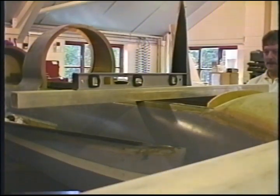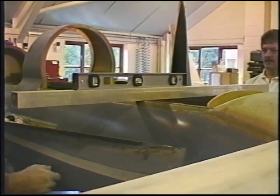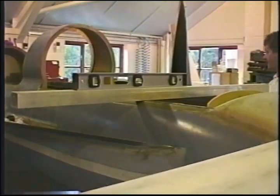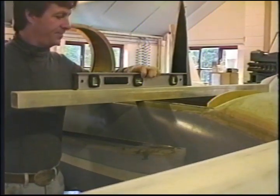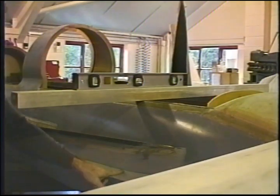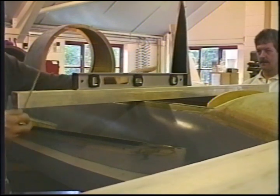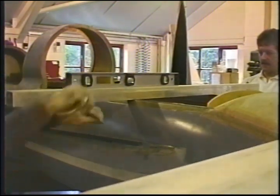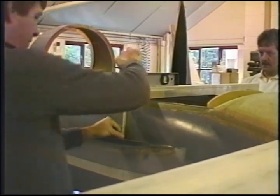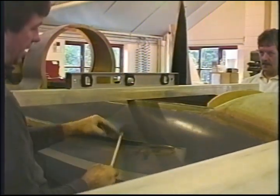Okay, we're back. We're going to show you what we do for transferring measurements. Get the tape. I got a little here. It's level. We're at the 79 station. Any one of the stations here will suffice. I'm going to come back just a touch so I can get to the front face. Go down to the inside, give them a dimension, 7.5 inches, plus a 32nd.